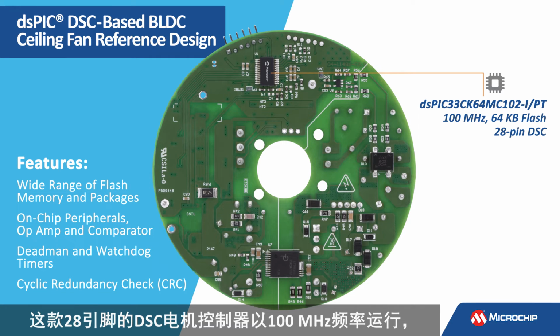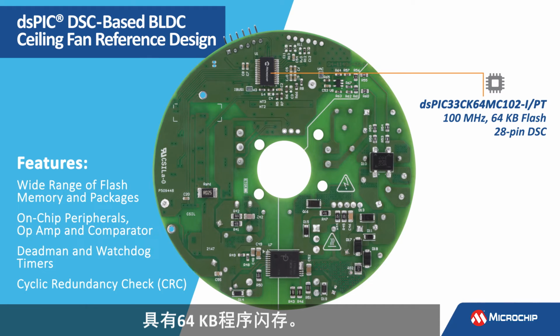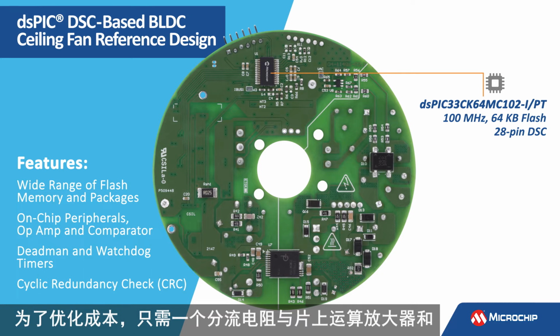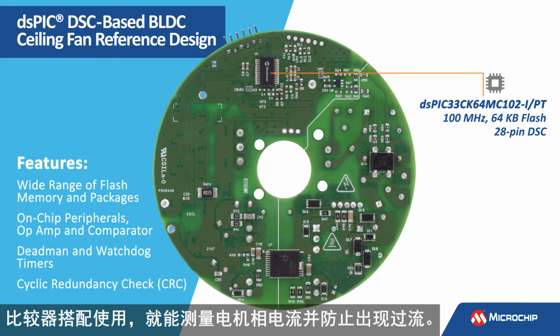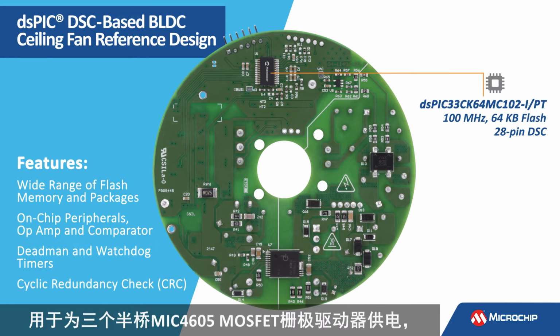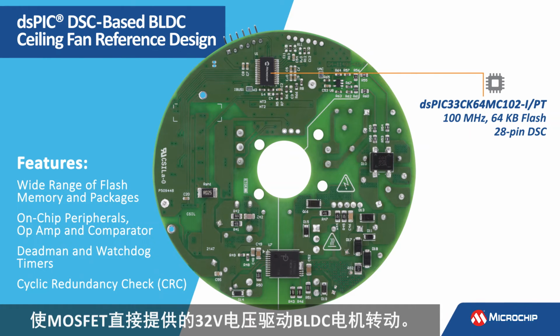This 28-pin DSC motor controller runs at 100 MHz with 64 KB of program flash memory. It runs the FOC algorithm, which derives the maximum torque and top efficiency from the 3-phase BLDC motor. To optimize the cost, only a single shunt resistor is used, along with an on-chip op-amp and comparator to measure the motor phase current and guard against an overcurrent condition. The dsPIC DSC provides the 6 PWM outputs to the 3 half-bridge MIC 4605 MOSFET gate drivers, which direct the MOSFETs to provide 32 volts to spin the BLDC motor.